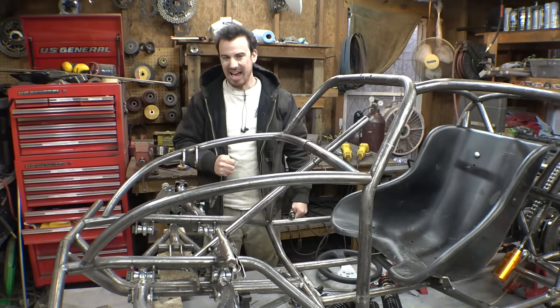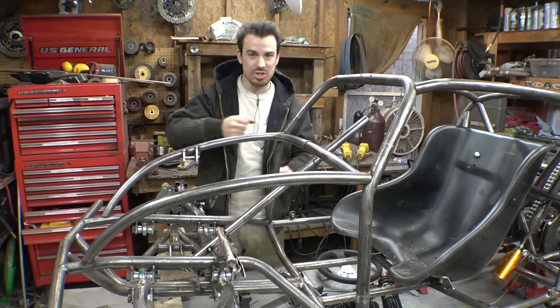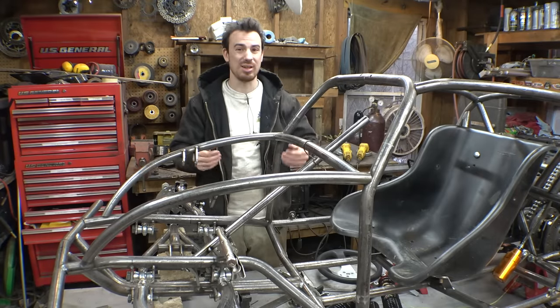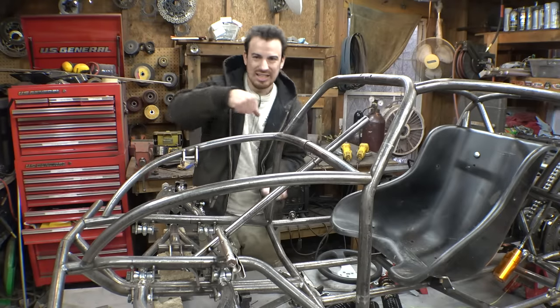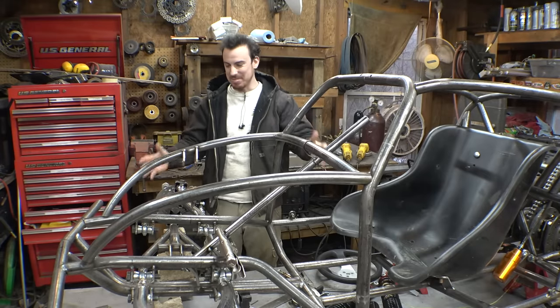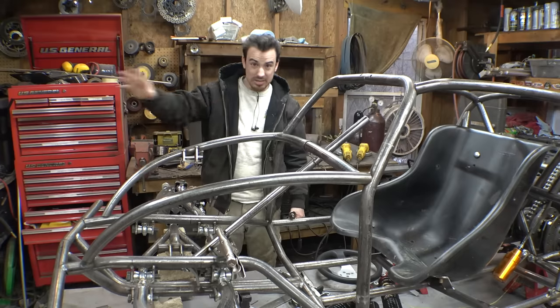So I may have to fiddle around with this a little bit more to get a good ratio of steering. We don't want this too touchy, too twitchy, because of how fast this thing's going to go. But we also want to make sure that I can go lock to lock easily, so I'll probably have to fine-tune this a little bit. But at least it doesn't have bump steer, which is a miracle. So now, I'm probably just going to save all that for the next video of this project.